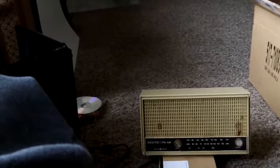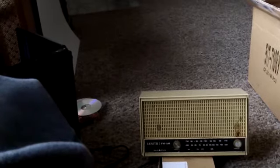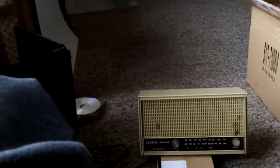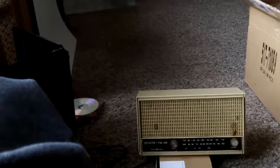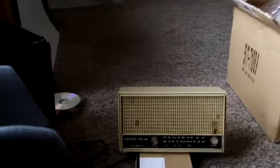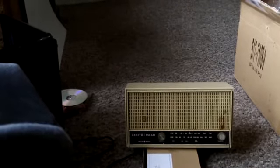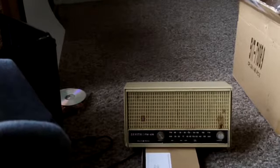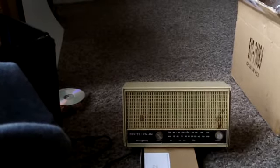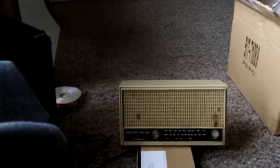More importantly, the one that's just like this one here doesn't work — it says it doesn't work. So I'm going to try to take a signal from one radio and inject it into the other to see if I can get it working that way. This will be interesting to follow along with. If it works out, people that don't have signal generators, signal tracers, or any other test equipment can actually use another radio. And it doesn't have to be the same type — it can be a mix — because there's going to be no DC connection between the radios.